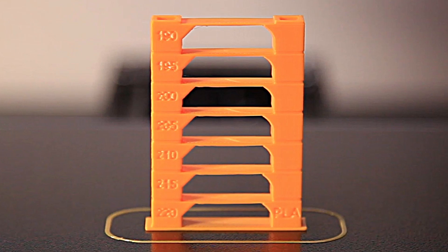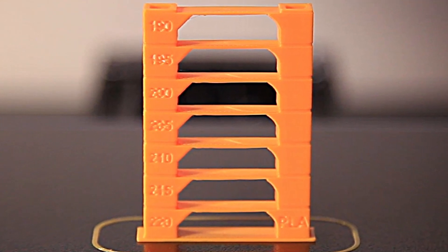So if two zones look identical, always print at the highest possible temperature. If the part you're going to print is more functional, then choose the higher temperature zone that still looks good enough. Because if the part is functional, you may not care if it's aesthetically great looking — you may be more concerned with how strong it is, and should therefore print at the highest possible temperature. Overall, pay attention to things like bridging capabilities, how small features are printed, as well as overhangs. Paying close attention to these things will help you maximize both the look and the strength of your 3D print.